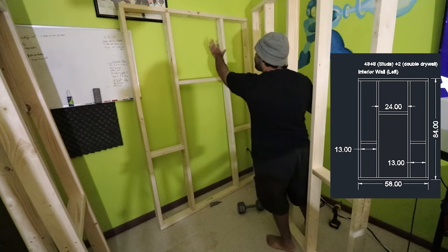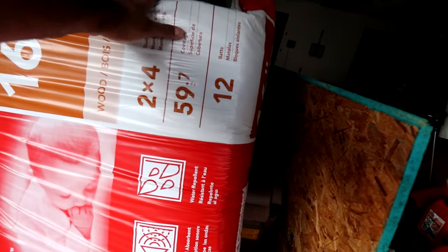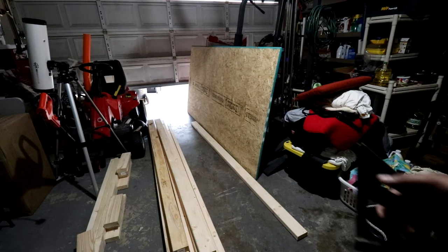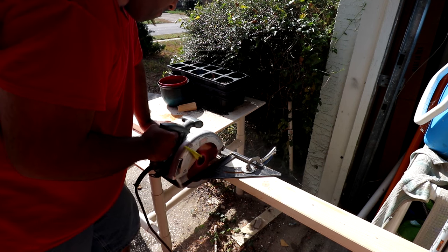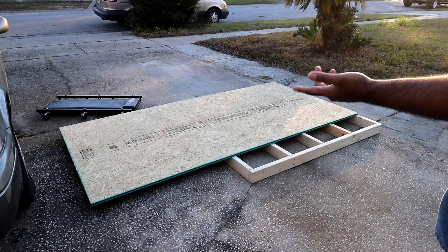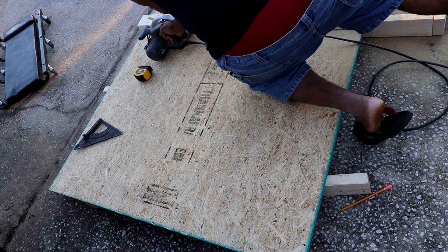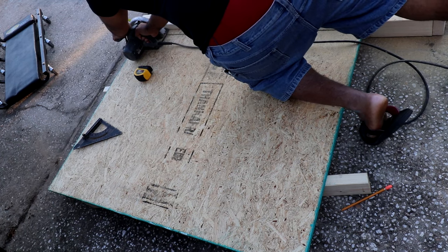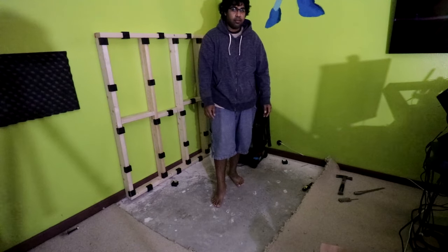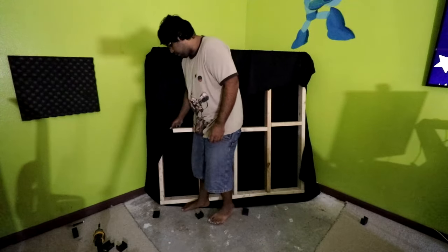This is the right side of the wall — the wall facing me when I'm sitting down. Right here we have rock wool insulation; this is what's needed for the floor that I'm gonna build. I'm also using drywall screws and sub floor adhesive. My cousin finally gave me a right angle. You can see I'm framing up the floor joist making it pretty much stable. I have the OSB board — this is gonna be the subfloor — cutting it down to size using the circle saw. Now I have it in my room. You see these little black things — these are ISO joists, to prevent rumble from the floor. It's pretty much isolation.